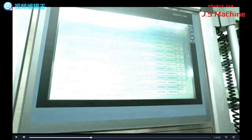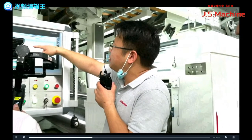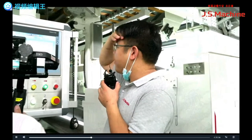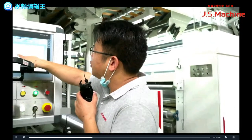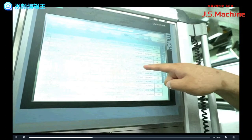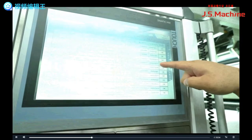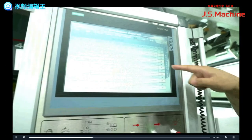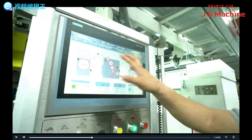You can do it either by oil gun, or simply with a brush and some machine oil. And it also indicates the model or the type of the grease. For example, this one is for the 200 degrees Celsius high temperature grease, and this is the serial number and model. Okay, and this is the time that you had your latest maintenance, and that's the estimated time that you will do the next maintenance. Okay, if everything is confirmed, click OK here.